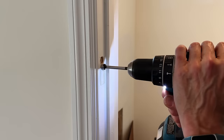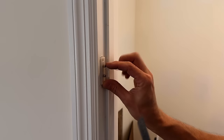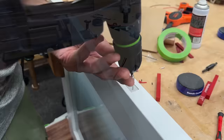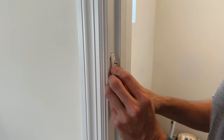Here's the contact switch. The original plan was to use an electrified hinge with flexible conduit to run the wires through, but those are only available for thicker commercial doors. So we went the contact switch route — I mortised it into the door jamb and ran my wires through there, and made a mating mortise in the door itself as a step mortise around the hole drilled earlier for the wires. Once done, I cut the wires to length, wired up the contact switch — strip the wires, slide into the holes, tighten the screws with the smallest screwdriver ever — then pushed it into the door frame and screwed it home.